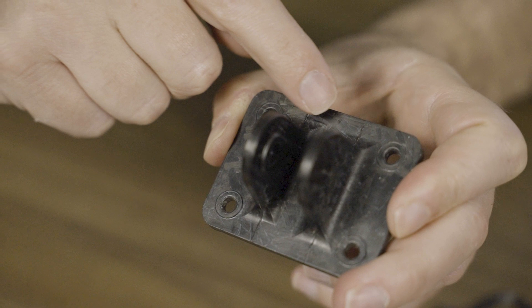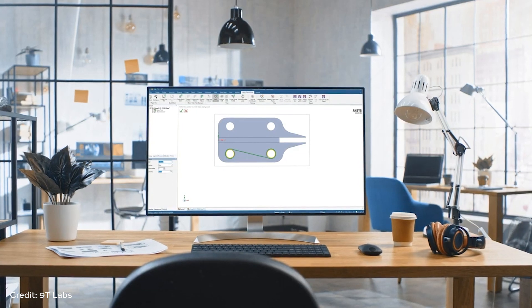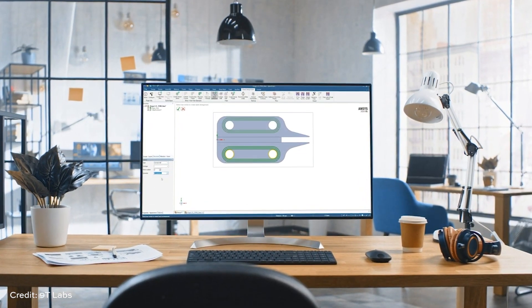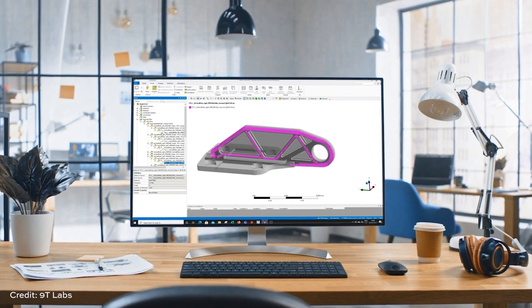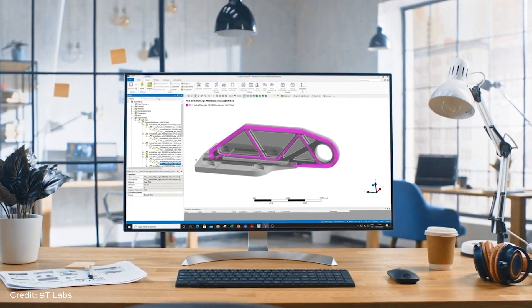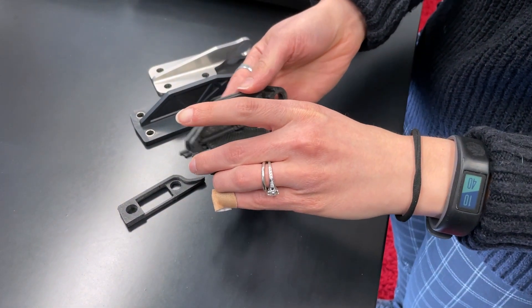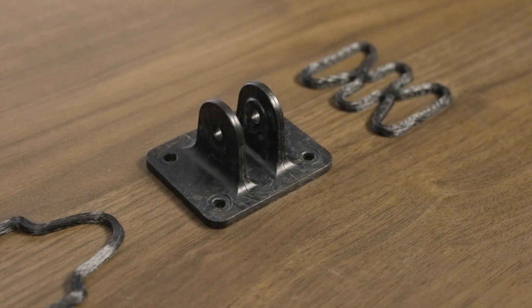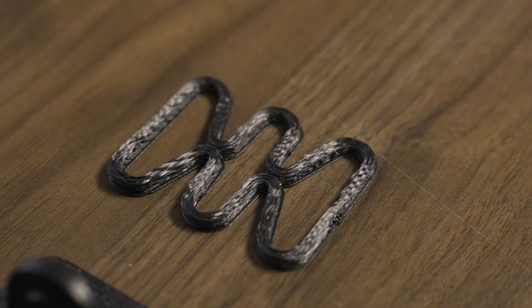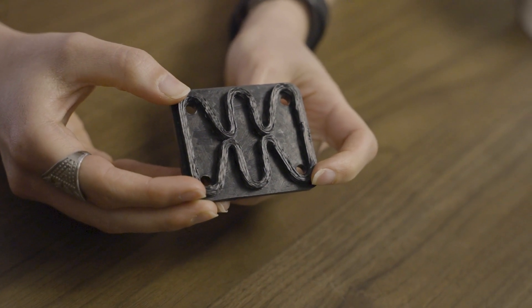There are some parting lines here from the molding. The primary role of 3D printing in this process is to get the carbon fiber reinforcement in the right place within the part — to get the strength in the right location and orientation, which is an important value of composites. In the previous bracket, 3D printing was used to create the carbon fiber reinforcement and also the planar plastic material that made up the form of the bracket. This bracket uses 3D printing only for that continuous fiber reinforcement, so in one sense it's using 3D printing more minimally, but in another sense it's concentrating 3D printing on just the most important part of the bracket form.